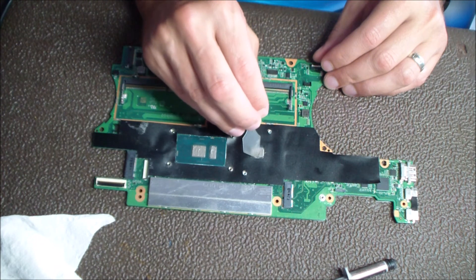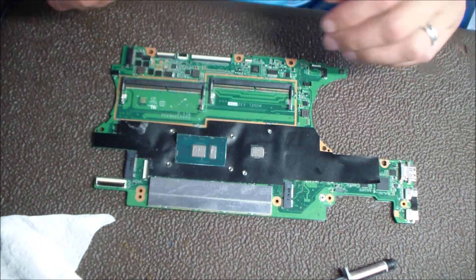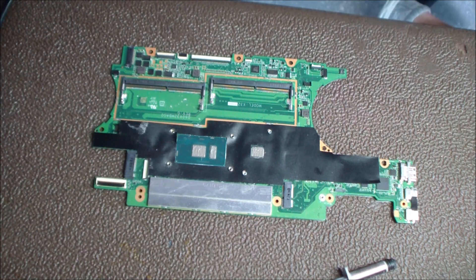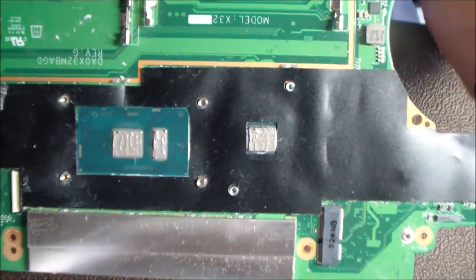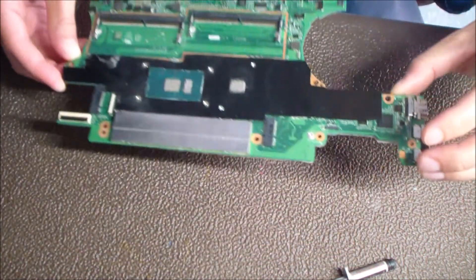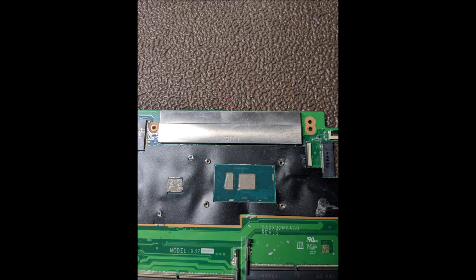If you don't have the tool that came with my Arctic Silver 5, you can use anything like a guitar pick or any kind of plastic piece to smooth out that thermal compound. You don't want to use your finger — you can have grease on it. As you can see here, it's just covered most of the die, spread out the best you can. Just try to remove those air bubbles as best as you can. And here's a picture of what it looks like when it's all done in better lighting. Thanks for watching — if you have any questions, just leave a comment.